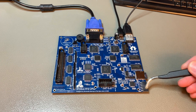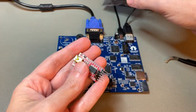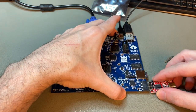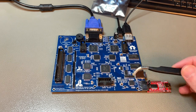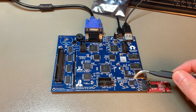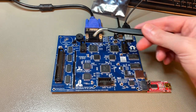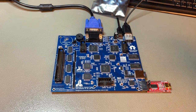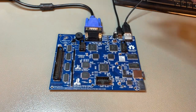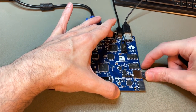On the side there are two more connectors. This one is for an FTDI adapter — something with an FTDI chip you connect here and then USB or mini-USB to your computer. You use it to reprogram the firmware residing in the flash memory of this ATmega 328PB. It has 32 kilobytes of flash — that's where the BIOS, the kernel, the operating system resides. Because it's in built-in flash, it doesn't use any address space.